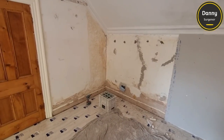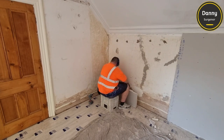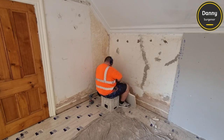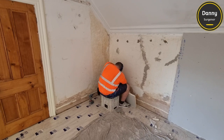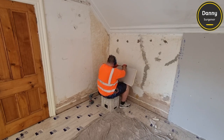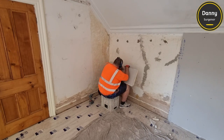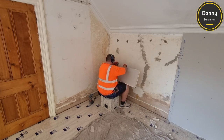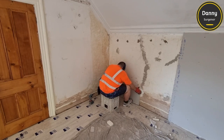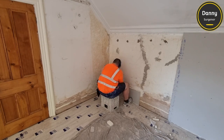It's hard finishing around the sockets. When I'm doing the sockets, I'll always get the socket in the middle of a full board. You can see I put a full board to the right-hand side there, and then instead of putting a full board right next to it with the socket falling between two boards, I will always line the socket up in the middle of a board. Or if the socket is against the wall, I'll put the board tight to the wall and it will always be a full sheet.